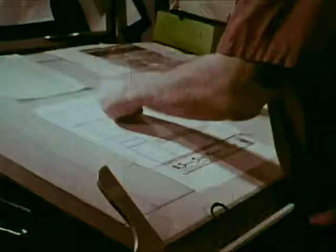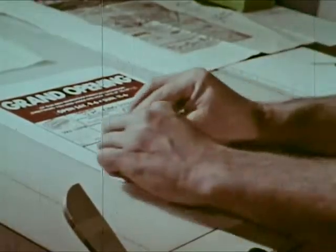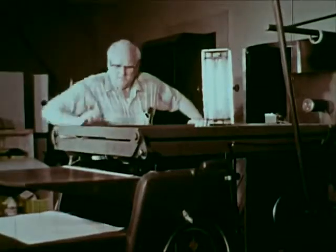Photo type, illustrations, and similar copy are combined to create a paste-up of the ad. Display ads and news photos are engraved. They are photographed with a special camera, and the copy is photographed through a fine screen of 65 lines to the inch. The screen produces a pattern of dots, as shown in this magnified illustration.